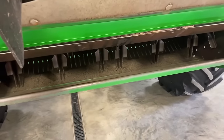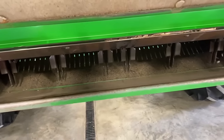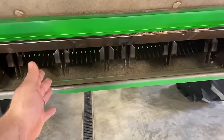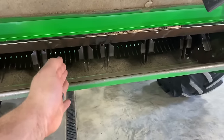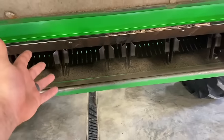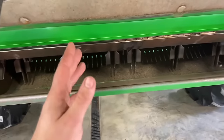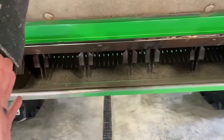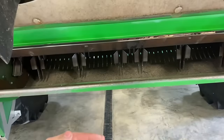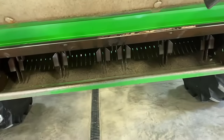When I say these chopper hammers are iffy — when I go back to the shop I'll fill out an inspection sheet on my computer. I mark items red if they need replaced right now, yellow if they can possibly run another year, and green if they're good to go. Something like this, where the chopper hammers are showing wear and are a bit dull, I would put them in yellow. If they were completely toast and needed replacing before next year, I'd put them in red. The customer can look at all his red items and know what needs replaced now, then decide whether or not to go ahead with the yellow items as well.